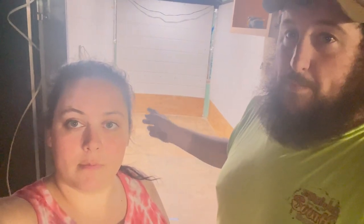We got a lot done tonight. We got three walls in — the shiplap looks really nice. We also got the cabinet hung. If you look along the bottom, you can see we did plywood — the plywood that we ripped out, we put on the bottom. The reason we did that is because when we put the two side benches in, we're actually going to make them removable. We're going to buy furniture clips, probably from Amazon — we can link them.